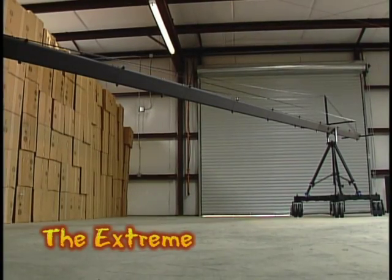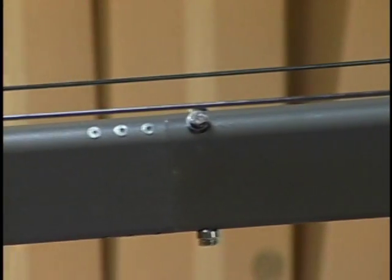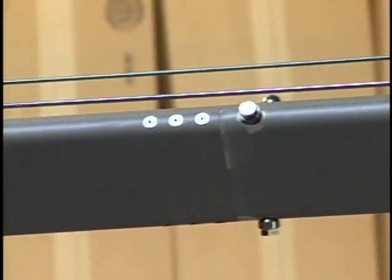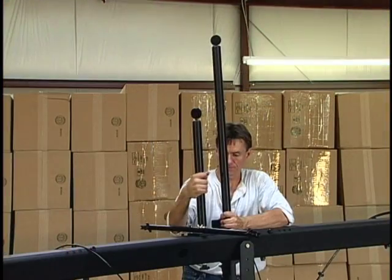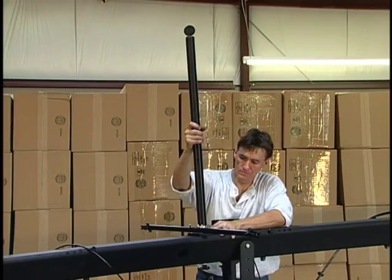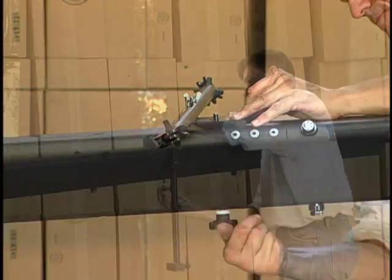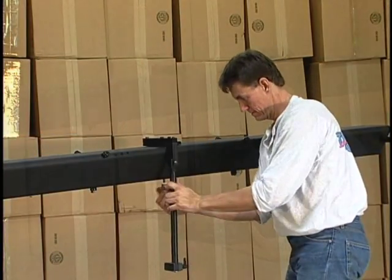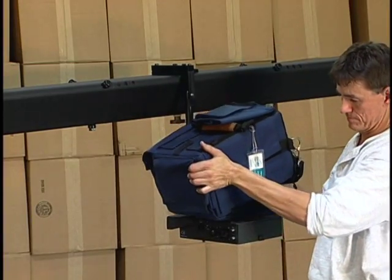The Extreme has a 30-foot reach and a 32-foot height. It has 2 more sections than the Super Plus, for a total of 8 between the pedestal and the front section. It adds a 3rd section on the rear. It uses an even taller vertical strut and a second cross strut up front. It also uses a swinging monitor platform to bring the monitor and control box closer to the rear controls.